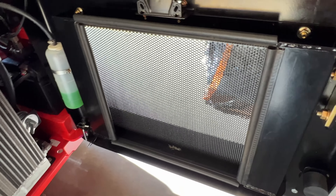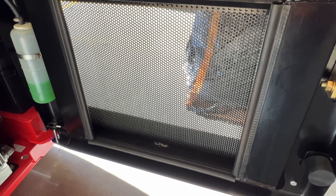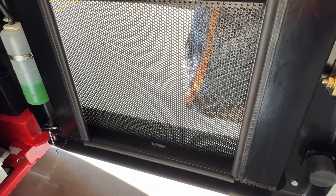Before you close the rear door, it's always great to check for debris. If there is chaff or other material sitting on the rear door blocking your cooler, it's a good idea to blow it out using a compressor, brush, or other element.